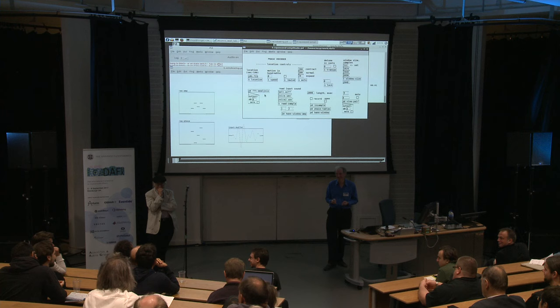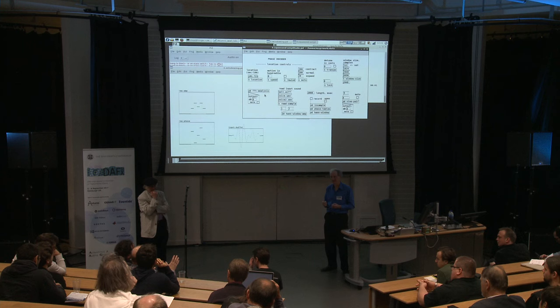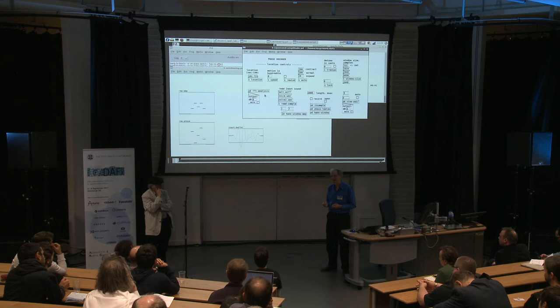Right. But yeah, the maximum likelihood approach is, if you assume there are two sinusoids, then you basically have a two sinusoid model and you just try all frequency separations and relative phases until you nail it. You know, it's the brute force match, and that would be the standard maximum likelihood answer. Right. And that's going to be amplitude and phase. Right. But that makes such a strong assumption of the nature of the signal that you're looking at that I don't know, even if this thing doesn't actually do maximum likelihood, doesn't make the Cramér-Rao bound or anything like that, maybe it actually works better anyway in real situations. Who knows? I mean, there's no model.